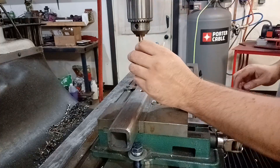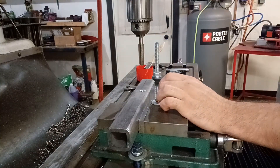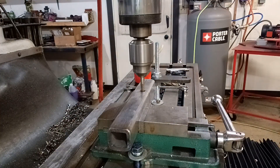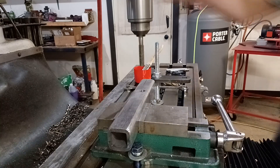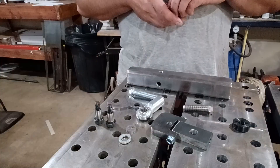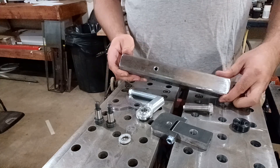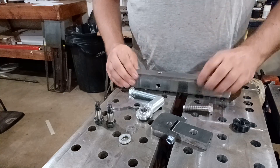You can do this tapping by hand; I'm doing it on a milling machine because three horsepower is a lot easier than by hand. For this next part, we're going to do a little bit of assembly before we weld, because we're using the assembly to line everything up. Now that you have your 3/8-16 hole and your double-tapped 1/2-13 hole that goes all the way through, we are going to start to put this together.